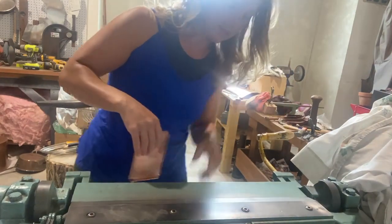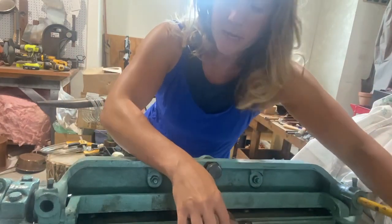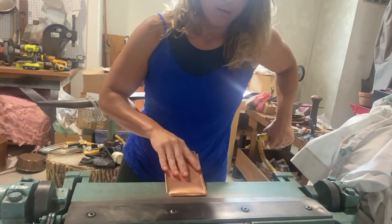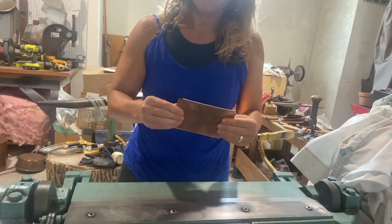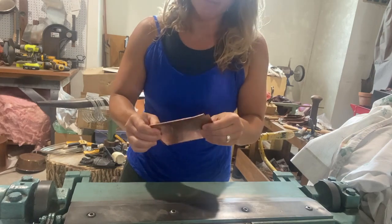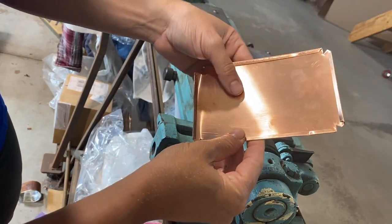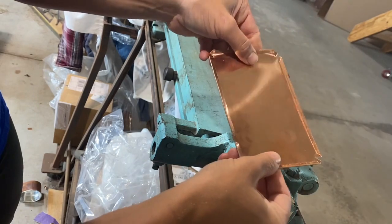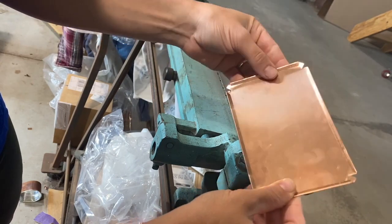My bar folder jumps - it needs to be tightened and I'm too lazy to do that right now. There's just too many things going on. Anyway, these are actually an eighth of an inch instead of a quarter of an inch because this is a smaller piece in terms of what I folded over. But now instead of folding these edges to the inside like we did with the box, I'm folding them to the outside. That's really all I'm doing differently.